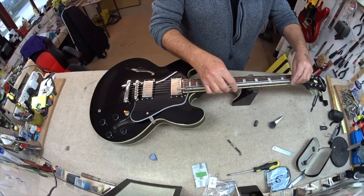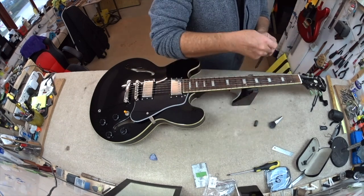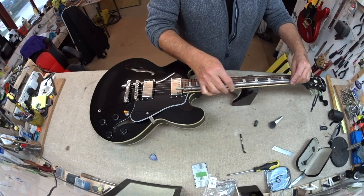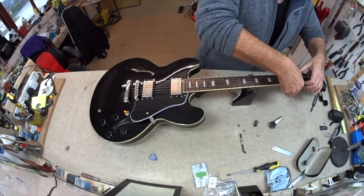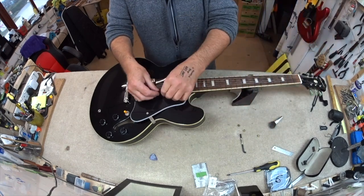Well, it means practically I'm doing the same thing as before. I'm aiming to calibrate the truss rod so that it mirrors the curve in the neck, however slight it is, and it's very, very slight in this case. There's about right. And when it comes to doing the leveling, I'm going to use it very, very lightly, because I'm not after a single fret.